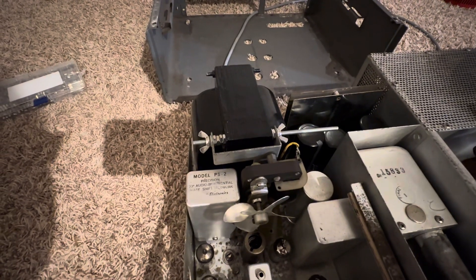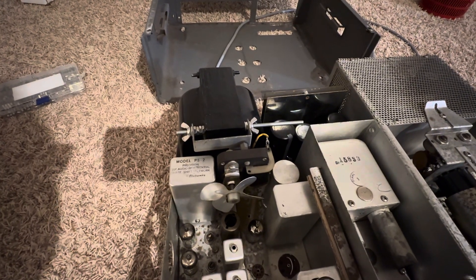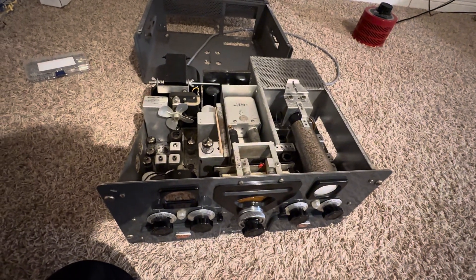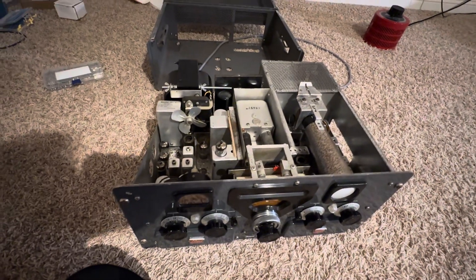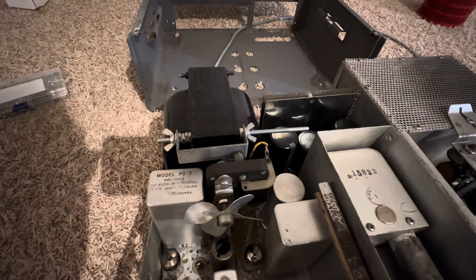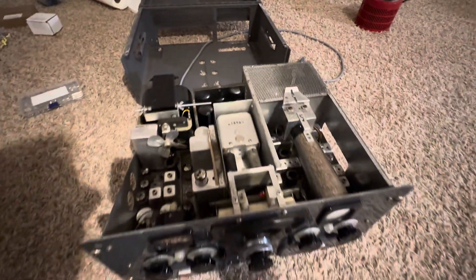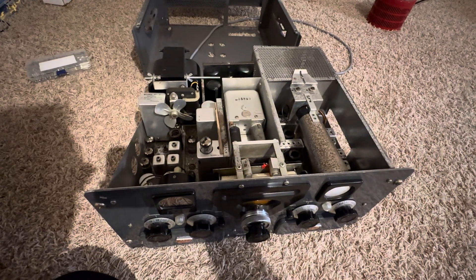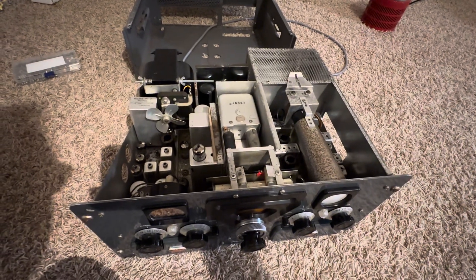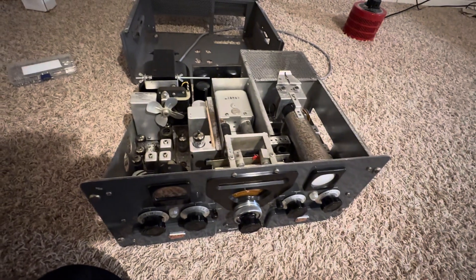I think if I put resistors in series with the secondary leads, that's not a real good solution — they get hot as they should, but I don't think it delivers good current to the finals. You really need the right power supply, something that's right around where it should be. So that requires a new transformer. It's too bad this transformer didn't work out. The guy I got it from is so busy, I don't think he could pull another one out of his storage and check the secondary for me. I think I'm on my own to fix this thing with a decent transformer. I should have probably bought a 200V — which is the successor to this — that didn't have any problems with the power supply, maybe one that even worked. Anyway, that's my little story, the Tale of Woe. I hope things are going well for you, and thanks for watching my videos. Have a great day.